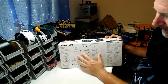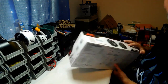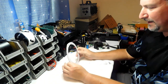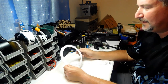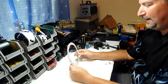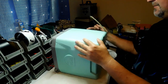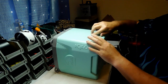The JVC speakers come with a template on the back — other manufacturers include a paper template, but you cut this out and get a nice little ring. Put this on your cooler, line it up the way you want it, use a tape measure to make sure both sides are even, draw a line on the inside diameter, and we're going to use a jigsaw to cut it out. The cooler has a seam right down the middle which is a helpful reference.